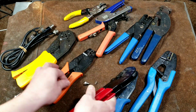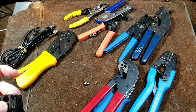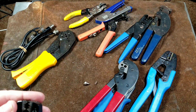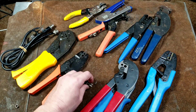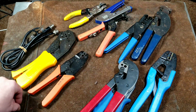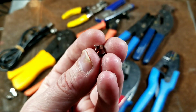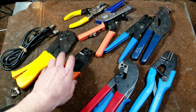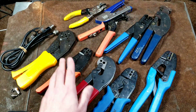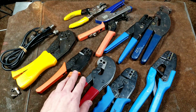Nope, this needs the next smaller size. It turns out that you really need these little collars to have a cable inside them to keep their shape — otherwise they just want to fold and get pinched inappropriately instead of crimping properly. I never actually tried crunching those without actually having a cable inside.